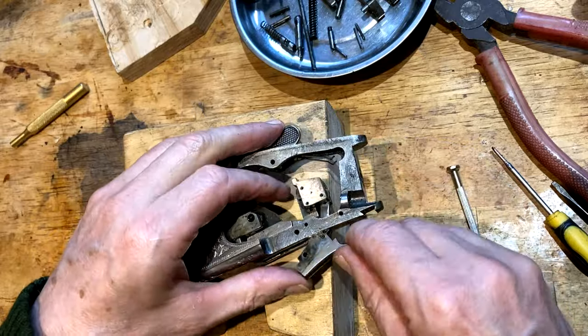I will put some grease in this channel because if it's being used in live sporting, water gets in through the bottom, the slide comes underneath and into the firing tunnels, the striker pin tunnels. Then you do want to protect this area by putting some grease in. Although, you know, rotational stuff can be done with oil, it's a customer's choice.